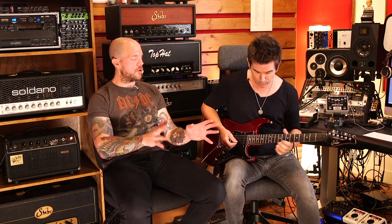What I find pleasing going to Alnico II — it's a little more singing and a little rounder on the top end. It's got a spongy, slightly softer thing on the bottom end compared to Alnico V, which is a little sharper with more treble attack. As you go from a 5 to a 4 to a 2, you're getting progressively a little rounder and sweeter on the top end. We also did a slightly hotter wind than my previous signature pickups — up to 9K, so it's on the hot end of a PAF but not really a hot pickup.